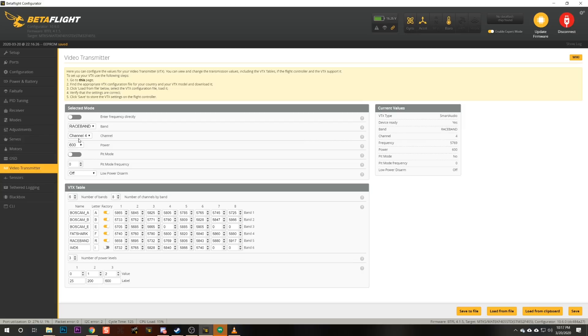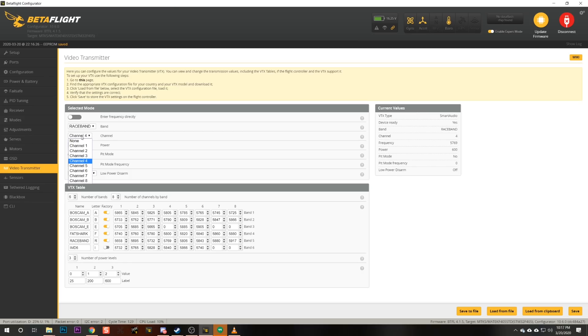I would suggest that if you are planning on racing, you set your output power to 25 milliwatts — that's what most races require. But most people building this quad are probably flying by themselves, with a couple friends, or doing longer range stuff, and you're going to want output power at the max of 600. As far as channels go, it doesn't really matter — no one channel is better than another. You just can't be on the same or too close to somebody else flying with you. I always pick race band channel eight because it's outside the range that WiFi uses — some channels overlap with WiFi and you'll see interference from nearby access points. I'll put a video about FPV channel best practices in the description.